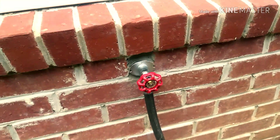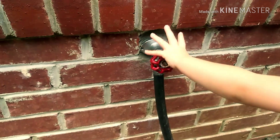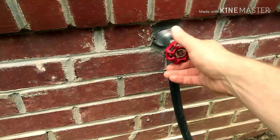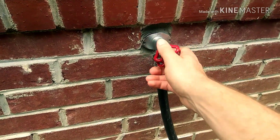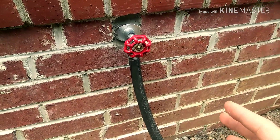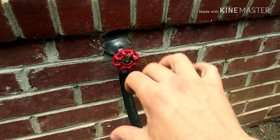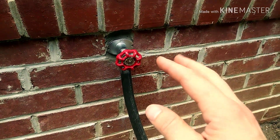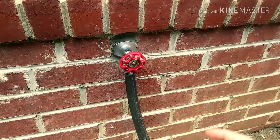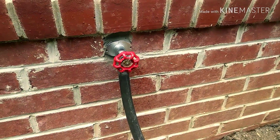Special thanks to Tim Borden for helping me fix this outdoor frost-free spout or spigot. So we'll turn this on a little bit. If you've got these frost-free spigots, Tim told me a pretty good tip: when you close them you don't have to bear down all the way until it completely closes, because then you'll stress out that gasket that's about a foot inside your house. On these frost-free spigots just hand-tighten them just enough to where it drains out and is done. Pretty good tip.